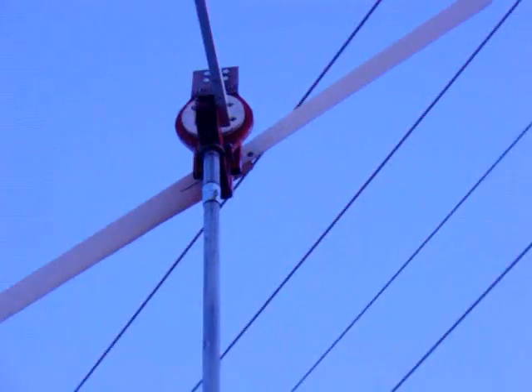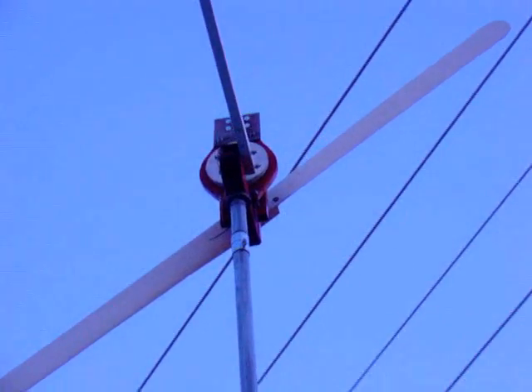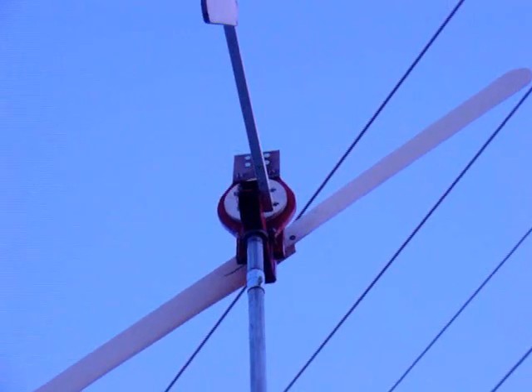I thought I'd share the wonderful beautiful sunset with you — it's right between a building and a tree. This bad boy just went through some high winds, and the pole didn't bend, but the high winds were only like 35 mph. I'm quite pleased but still want more output. Maybe bigger magnets or heavier wire. This 18-gauge comes out the bottom of the pole, runs up, then comes down inside the shop. Resistance causes a voltage drop — even though it comes down in AC, you still have losses.